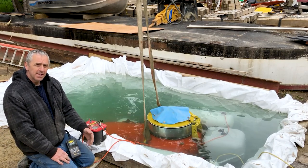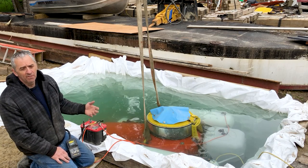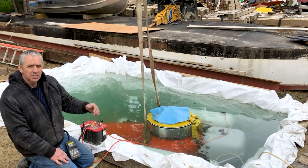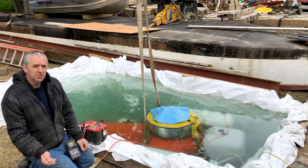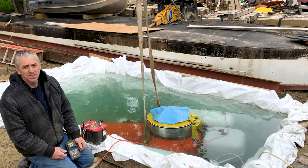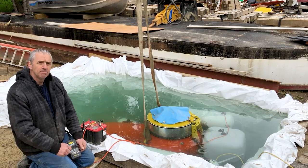The next step is I take it to Kootenay Lake and I'm going to do a 400-foot test dive with it — unmanned. I just sink it to the bottom. After one hour I pull on a string which releases air into the main ballast tanks and it surfaces, and then I just tow it back to shore. So until then, ciao!